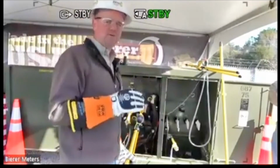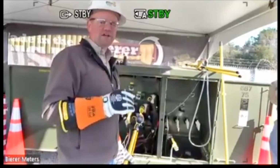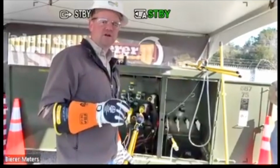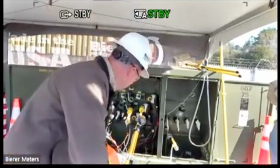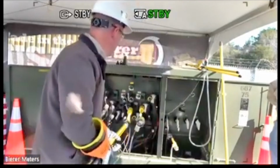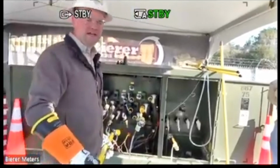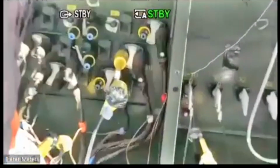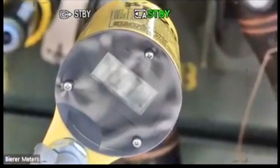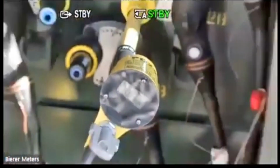Now, if this cable has a bolted fault, in other words, it's truly grounded, this number will be roughly 70% of phase to ground. Now, what does that mean? That means that it would be no different from essentially testing the high pot. So if I leave this high pot attached to an energized phase like this, and I take this second probe and touch the ground, you see that it's roughly about 10 kV thereabouts, right? And this is close to 14, it's 13.8 phase to ground. So there's your roughly 70% phase to ground.